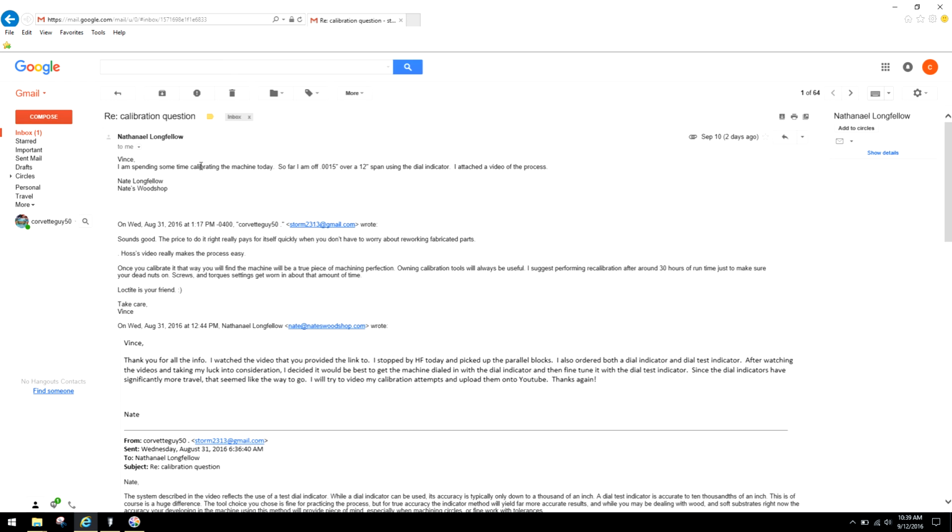And he wrote to me, Vince, I'm spending some time calibrating the machine today. So far, I'm off 1/1000 over a 12-inch span using a dial indicator. Guys, using that process that I discussed in my calibration video, if you haven't seen it, I seriously suggest you check it out. Even if you haven't bought your CNC yet, it's great information to know. Being off 1/1000 of an inch over 12 inches, for most projects, you're going to be fine. If you're doing woodworking, most guys are going to be way happy with that. That's pretty decent.